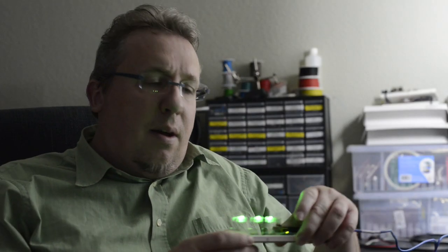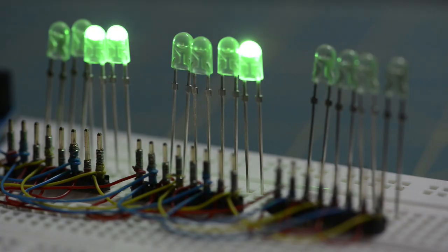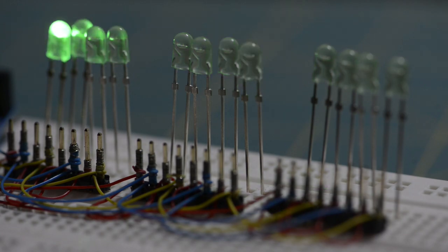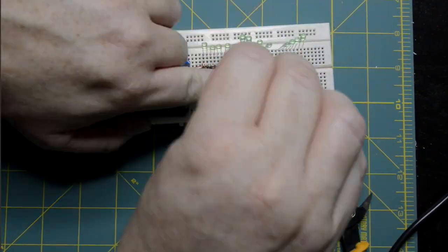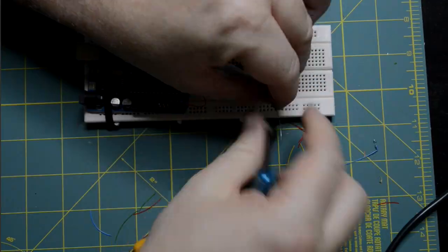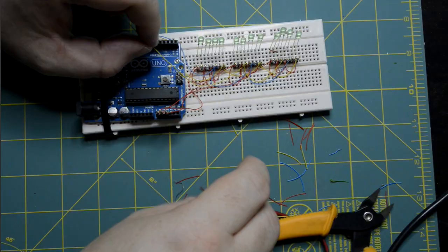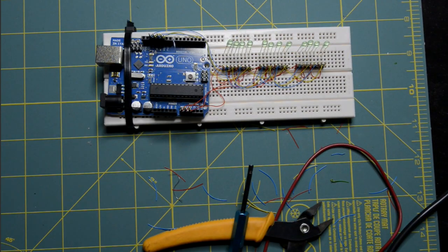This is a prototype that I made, put together with wire wrapping. That's kind of how I prototype these things. You can use jumper wires, but wire wrapping is better for something you want to keep or something more permanent that doesn't come apart when you poke at it.